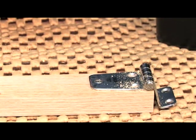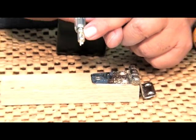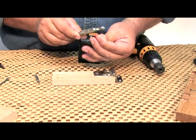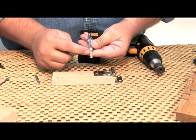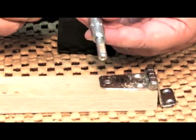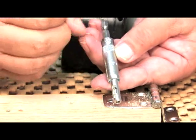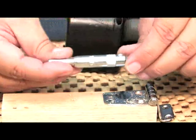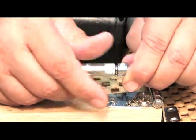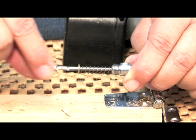One of the challenges you're going to run into occasionally is that sawdust will jam up inside the nose bushing. What happens is that spring contracts and the drill bit sticks out. Sometimes we can just give it a little tap and it'll come back. But if you let that sawdust continue to build up inside there, eventually it'll get jammed up. On every other self-centering drill bit you have to loosen up the set screw, and because of the compaction of that spring, the whole thing just kind of wants to explode on you. So what we've done at Snappy is we've added some knurls right here — you grab the knurl and simply take it apart. Once you've spun it apart, clean your sawdust out, and that easily you're back up and going again.